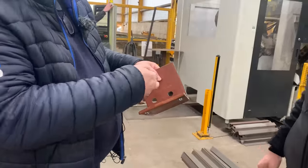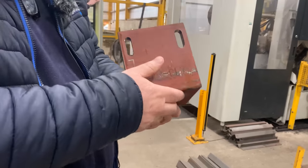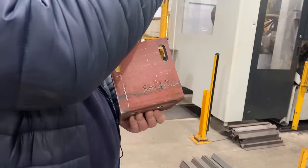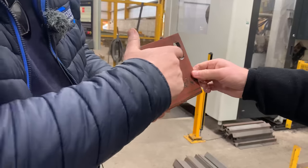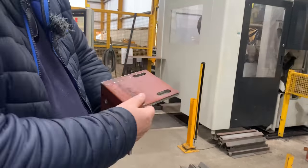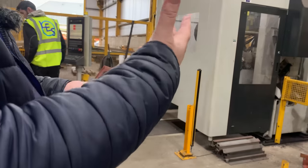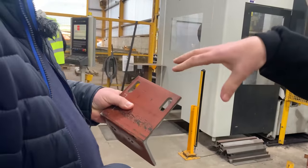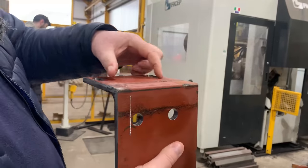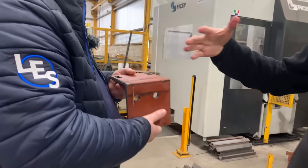You have a drill to drill a hole — a drill will never slot a hole. But in this case, this machine can do both. Most of the time you punch this hole, but in this particular machine it has a tooling. That's 100%. And why is that a different size to that one? Those two holes could be a 14mm, that one's a 12mm — the spec comes off the drawing for what the job requires. And it's a structural engineer specifying that. You also have two ordinary holes — there are probably both in two columns — and that's the slotted hole, probably for a purlin or a rail, to give flexibility to the erector.